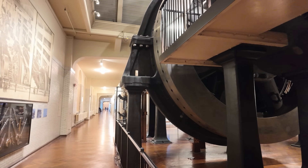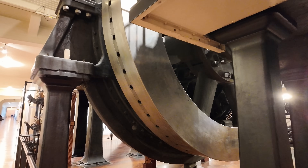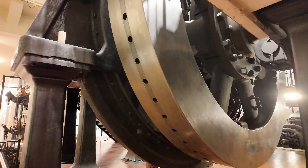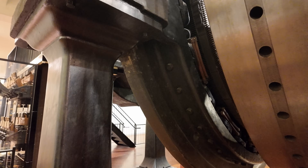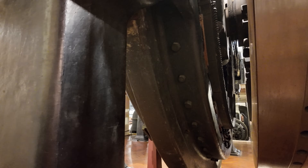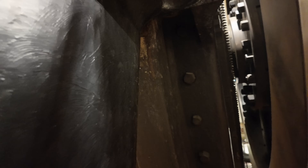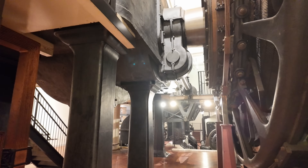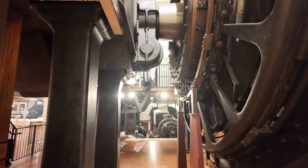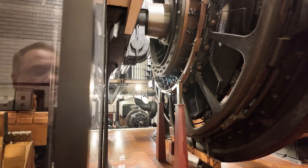This would have been the basement in the Highland Park plant — it's actually the main floor here at the Henry Ford Museum in Dearborn. The bottom half of the absolutely humongous generator. It's a DC generator, not AC, so Model Ts were all built with DC power. There are ropes connecting things that handle timing, a giant flywheel on the outside and the generator on this side. The flywheel being extremely heavy helped to maintain the exact speed, giving you a consistent speed which gave you consistent electrical power.